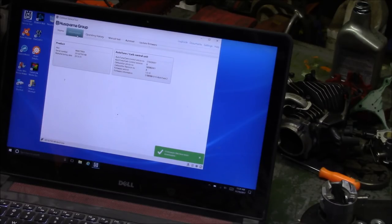Common Service Tool doesn't have a big billboard saying 'yes the saw is working as it should.' What it does is give you things to work from — it tells you a story about how that saw has been running. You look for error codes, but you also look at the last carb settings along with operating history to get an idea of how the saw has been performing. The whole concept of auto-tune is kind of interesting — you have this little valve in the carburetor that oscillates back and forth.